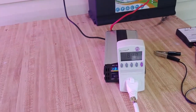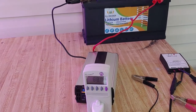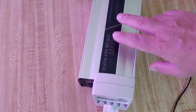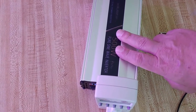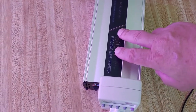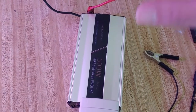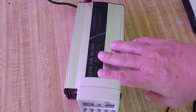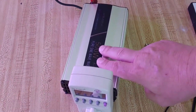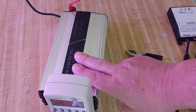What I did is I had a 200 watt modified inverter at first. I've now increased this to a 500 watt pure sine wave, mostly because of the pump. The porch garden has a water pump, and even small ones work in a way where they take modified sine wave not as well as a pure sine wave. So I switched it to a pure.